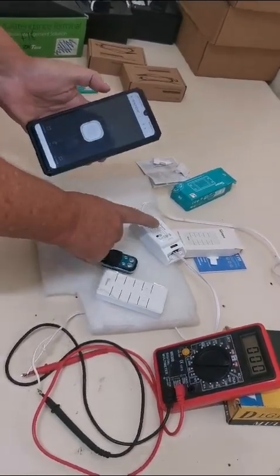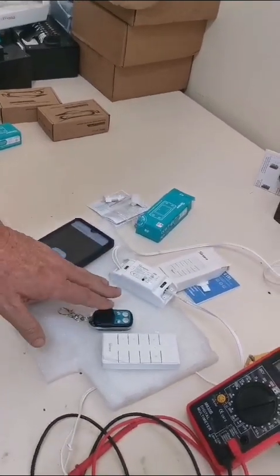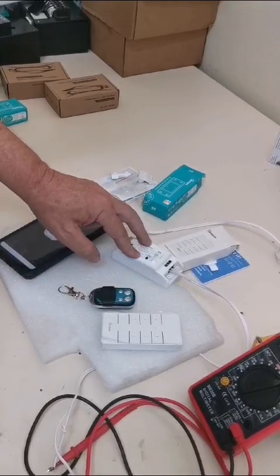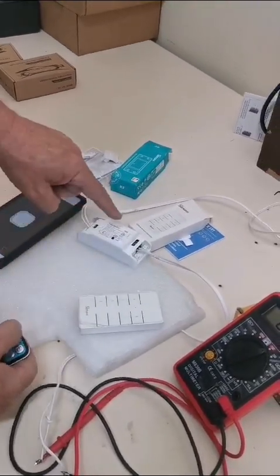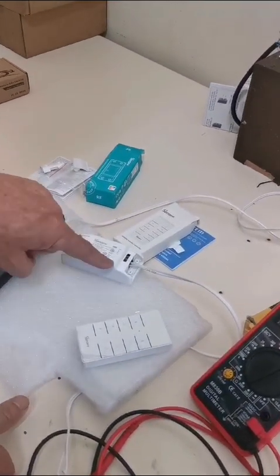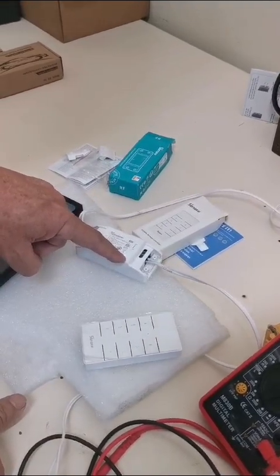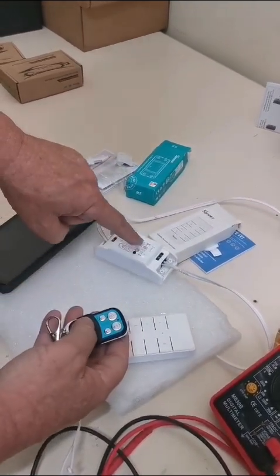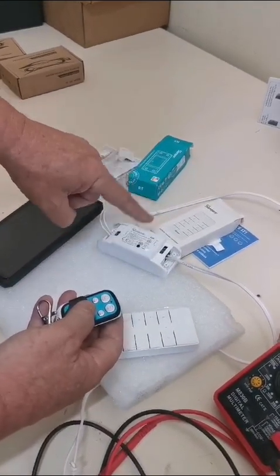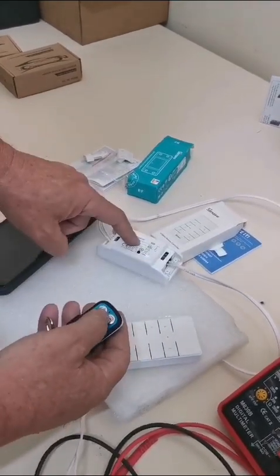That's all the configuration needed for this device, and you don't need Wi-Fi for the rest. Now we're going to communicate between the RF remotes and directly to this unit. There are two programming modes. The first one, as I showed, is after 10 seconds where the blue light flashes three times on, once off, three times on, once off. For the remotes, hold the button down until the light turns red. As soon as it turns red, let go the button and then push the button you want to program to the device.